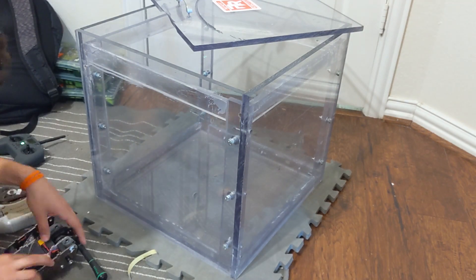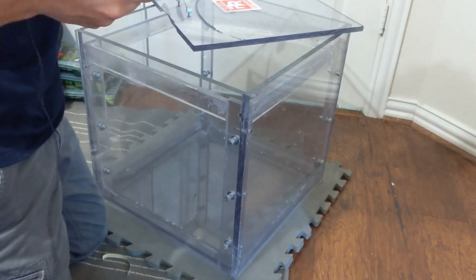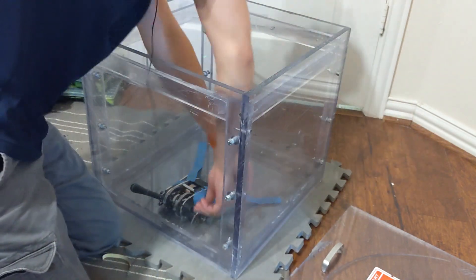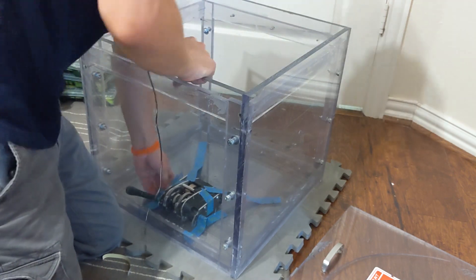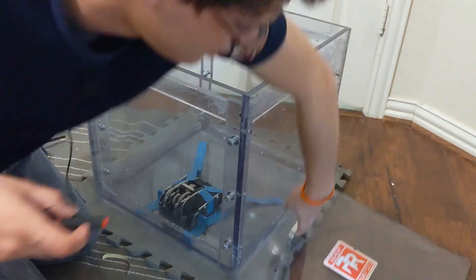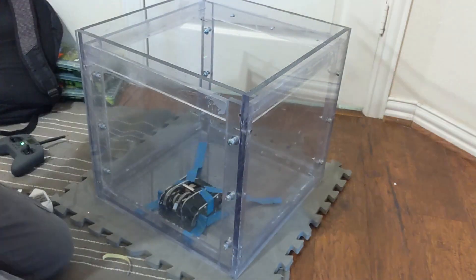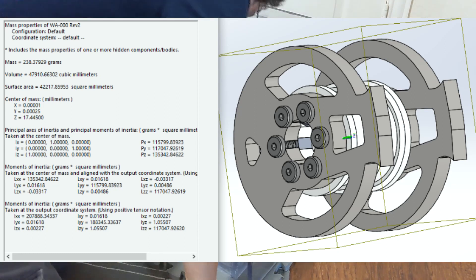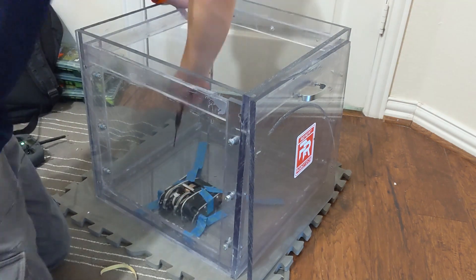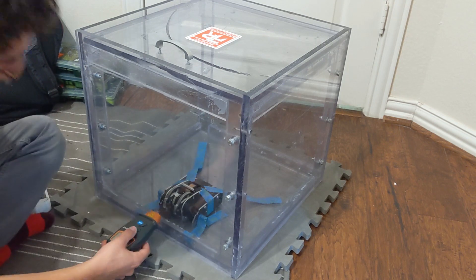Old Hound had a relatively small and slow weapon — a 2826 Amazon motor. I don't know the exact KV because the stator and rotor have changed a few times and I don't think they're original, so it's either 1,800 or 2,200 KV. The voltage is 11.1 volts and it's geared 3-to-1 down. The theoretical top speed is 8,140 RPM if it's 2,200 KV, or 6,660 RPM if it's 1,800 KV. Either way, the actual top speed is around 6,200 RPM. The moment of inertia is 117,000 grams millimeters squared, giving around 24 joules of energy. Ideally it gets 45 millimeters of bite, but that's a theoretical max — it never really achieved that much.